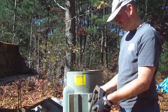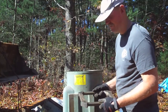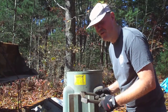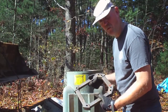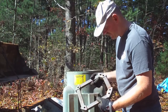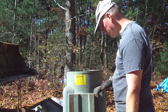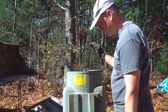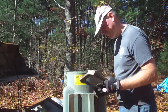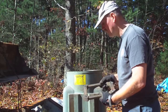I've got to give it credit for being as strong as it was and not failing. My point is, I'm thinking that was probably not a good way to lift this at all. I was very fortunate that I didn't have a major failure — breaking this bracket, having the turret rip off the top, having the machine fall, possibly damaging more items. My opinion now on the subject is: do not do what I had done.